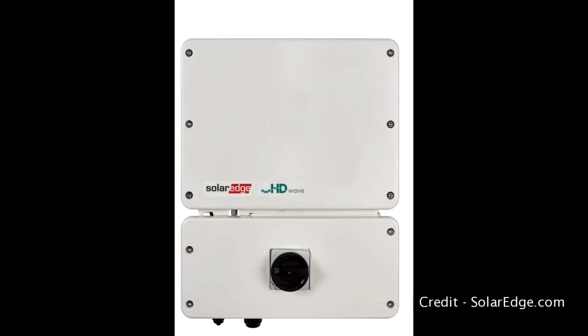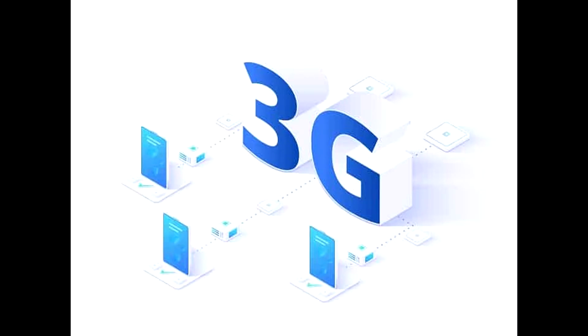If you go with the SolarEdge central inverter, make sure that the inverter can hook up to Wi-Fi. There are some models that only do 3G, and that expense is actually built into the contract, where it talks to the cell towers just like your phone, which is not a good thing because it's a set prepaid card that expires at some point.